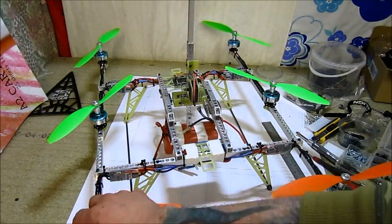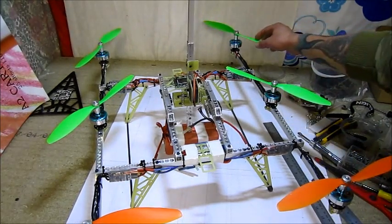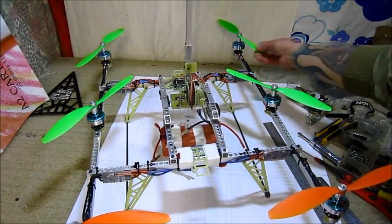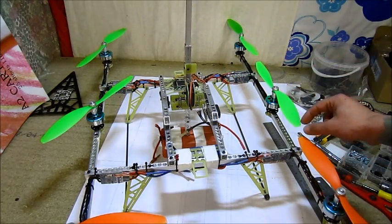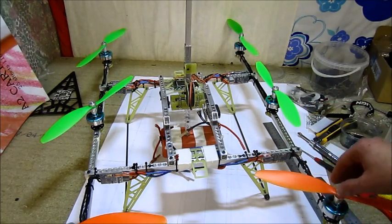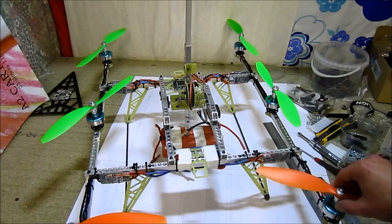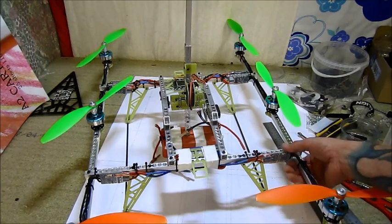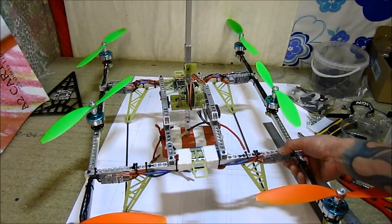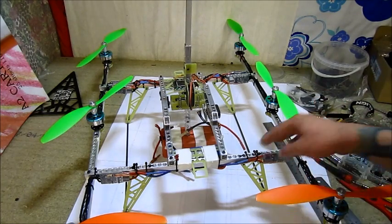The width is 42 centimeters motor to motor shaft, and the length is about 62 centimeters. The 11-inch props just fit, with approximately an inch of gap between them. Motors are DT700s — I replaced the shafts so I can put on a normal prop adapter. ESCs are HobbyKing Blue Series 30-amp ESCs.